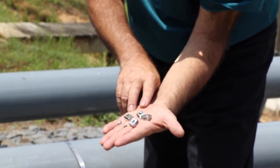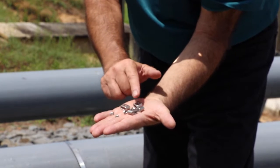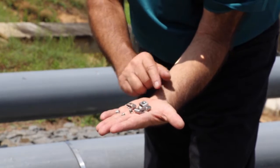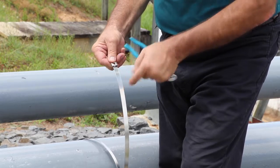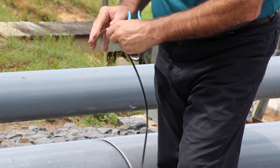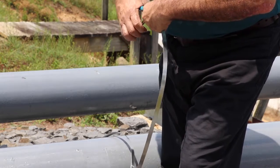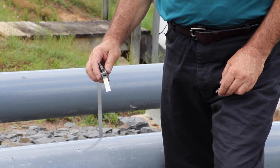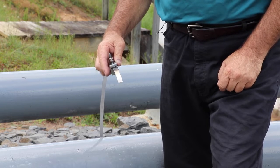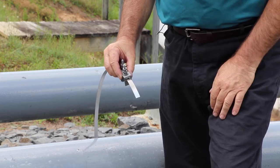Each set of stainless precision mounts comes with these keepers, which are used to fasten down the ends — these four brackets and these four hex head screws. To start, you want to find the threaded end of the keeper and put it towards the outside of the radius, then fold the strap back by an inch or two and give it a crimp. Now take the end pieces removed earlier from the precision mounts and thread them through the strap at the end that doesn't have the bend in it. If it's a single path it gets one; if it's a dual path it will get two, all the way up to four paths.